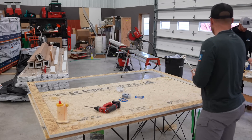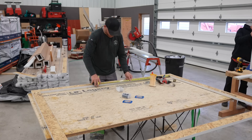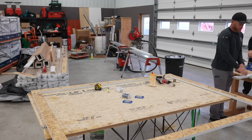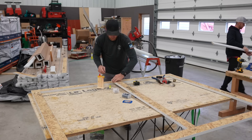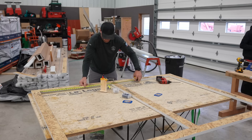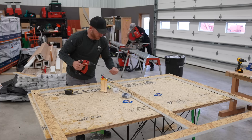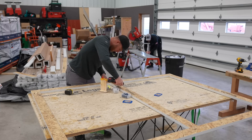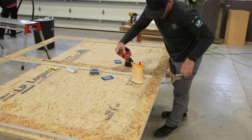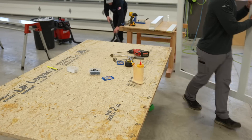Now that I have the outside done - our tape measure shows 37, so now we know where the middle goes. This is my middle piece. Eyeballed close to middle. Let's measure this real quick: 35, 13/16, 35 - just making sure it's exactly in the middle. This is our double window on the front gable - two double hungs put together - and we're going to have the trim right through the middle. We did our best when we installed the window to make sure all dimensions were accurate and consistent. With a window like this, it really pays to do pre-assembly because with all the random pieces and trying to get it to work out perfect, this will definitely be the easiest way to do it.